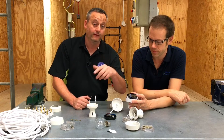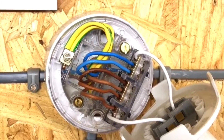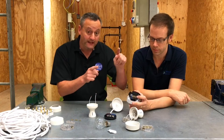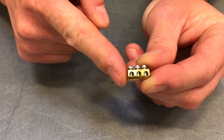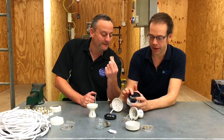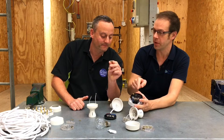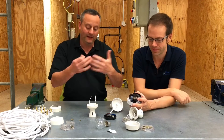So while we're covering popular misconceptions: that block of three — let's use that one as the example — is where your permanent line conductor can come in and go out, and there's usually one down to a switch as well, so it could be populated with three conductors, all brown. Our learners will look at the drawing and wonder which hole they need to put their line conductors into. Well, if you're putting it in there, it's going to be permanently live whichever hole you connect it into. So normally the right answer is whatever looks the neatest — that's the way forward when laying and dressing cables.